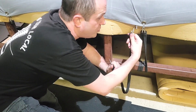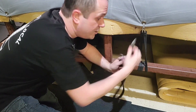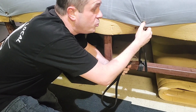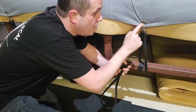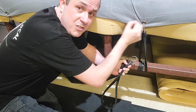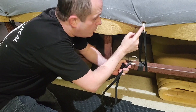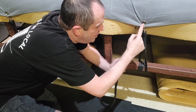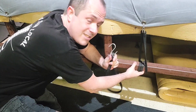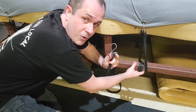So if you're going to use these, make sure you use them with the hook facing outboard, and you want to have them go straight up and down. The reason you want them straight up and down is because you want to pull on that grommet correctly. Those grommets will actually get popped out if force is applied in another direction. So you want it straight up and down like this, with all the tension pulling down on the side rail of the ring.